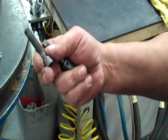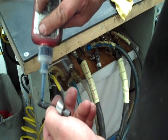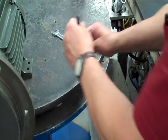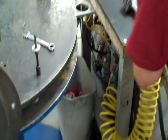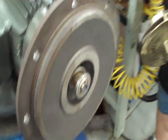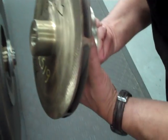Get the bolt and washer together and put a little bit of Loctite on the threads so it doesn't back off. Then get the impeller and the key — take the key and put it inside so that the key just comes up to about the lip of the impeller, and set it all together.